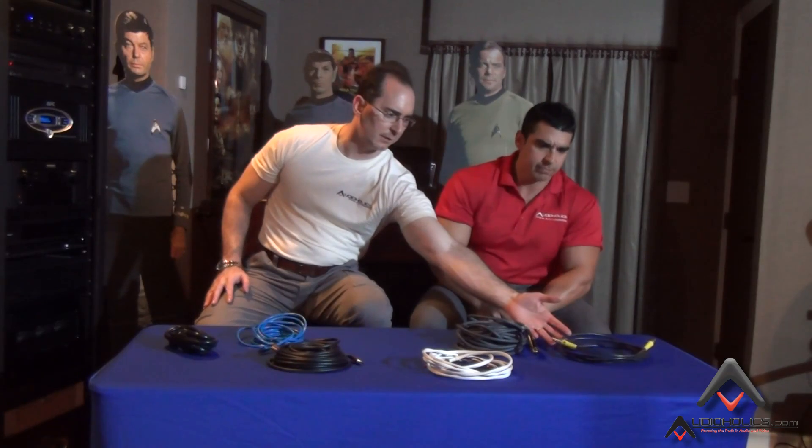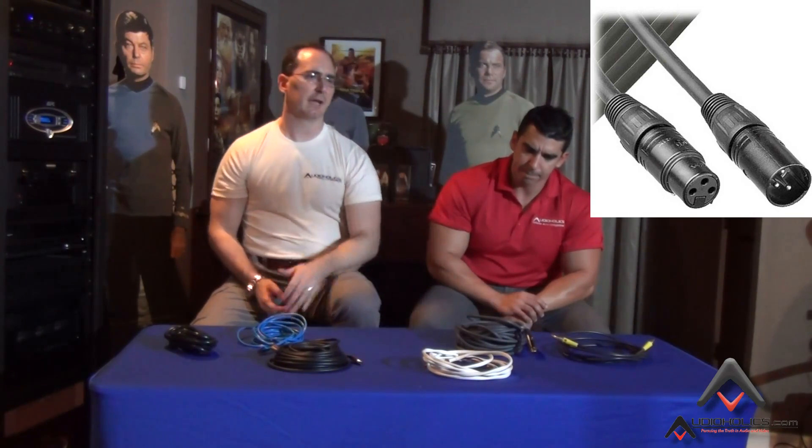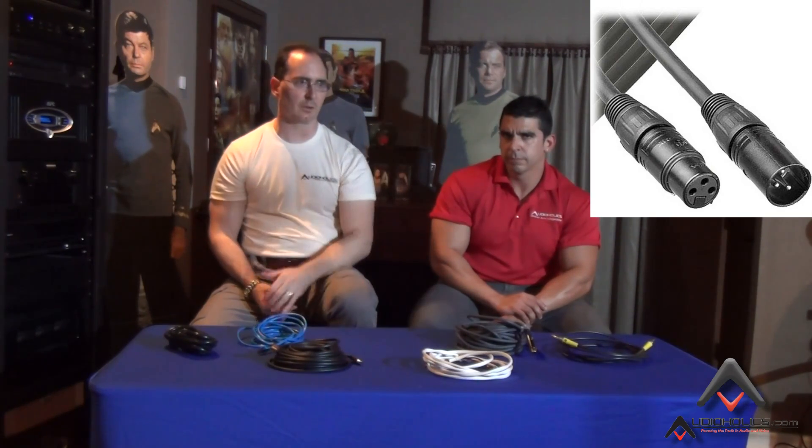You want the right cables and the right locations — especially you want to pre-wire for subwoofers. We never do one subwoofer in any of our theaters; we recommend at least two for better bass distribution. You should have a pre-wire on the side wall and maybe one on the back wall. I ran all unbalanced RCA level cable — RG6, from BlueJeans, some of the best RG6 on the market. I would have preferred to run balanced cables because you have fewer problems with ground issues and balanced makes a really firm connection.